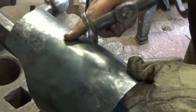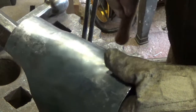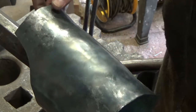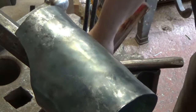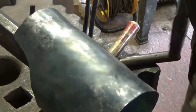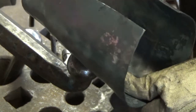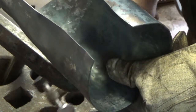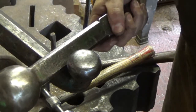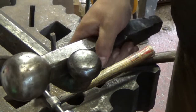Keeping this curvature on the top here can be a bit difficult if you're working down onto the face or something like this. What will happen more often than not is you'll end up flattening it. You can do it, it's just a bit hard work. So what I tend to do is I've got the stake over there with the slight recess - it's a slight dip in its profile. And given that getting inside this with a hammer can prove difficult even with a long neck hammer, what I prefer to do is get the stake that I used at the beginning - this beast - it's got a little bit of weight to it, and just use it on the inside.